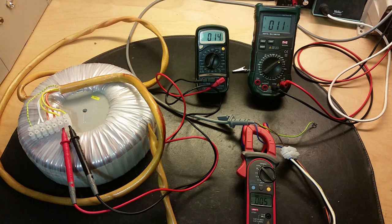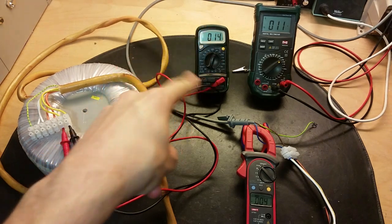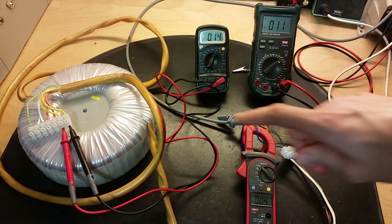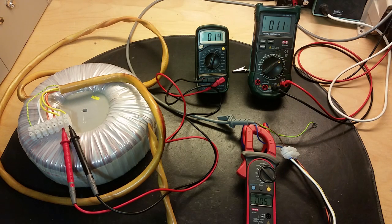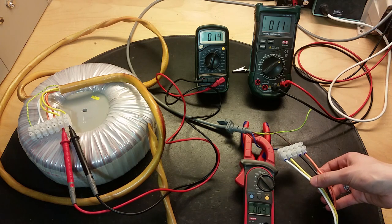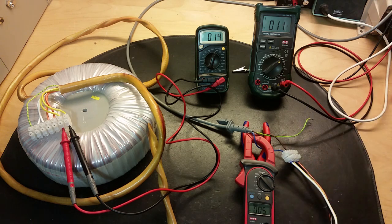It's pretty interesting how the core characteristics of transformers actually behave. We got a voltmeter on the output, a voltmeter for input, and a current meter for the input. We got to connect it up to the Variac. The transformer is connected to get the high leg delta voltage, or 208 volts, so we can have a bigger range on the Variac. It's otherwise just a normal isolation transformer, but we got some taps so we can use 230 volts, 208 volts, or 115 volts.